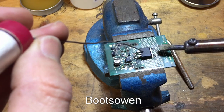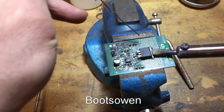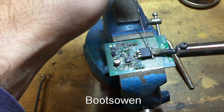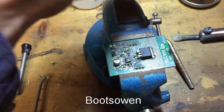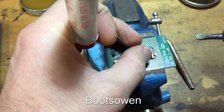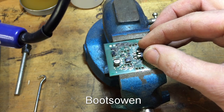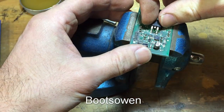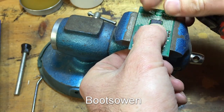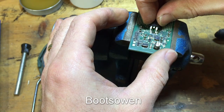It's quite a bit too hot really. I wonder could I clamp that somehow. The rosin's gotten hot but now I'm just messing it up. I could try to put the legs on it first — I don't want to overheat the transistor. But I have a feeling that's where we're getting to. Let me try to clamp that somehow. It should be all clean and then you're just putting an old dusty clamp on it. I'll latch it off over to the side because of these legs.